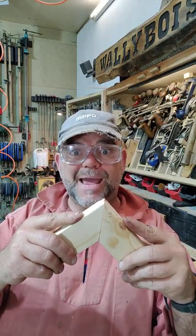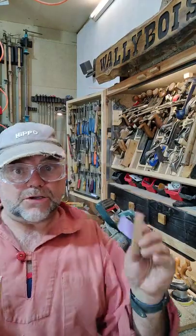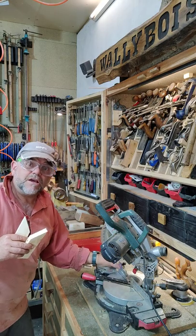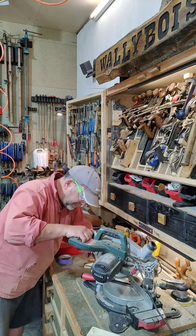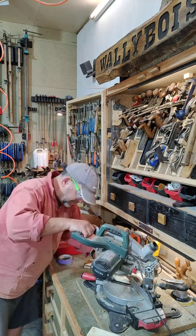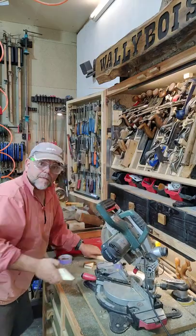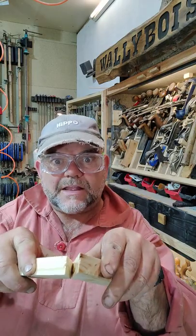What you should be doing is back-cutting your mitres just a fraction to allow for that. There's a quick tip and trick I'm going to show you. All you need is a little skinny bit of wood or a piece of card or something like that, and you tape it to the back fence at a fixed distance from the blade. Then cut your mitres just like this. When you put them together again, the gap will be on the other face and you won't be looking down a big fat gap. Simples.